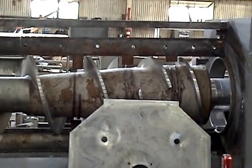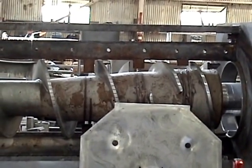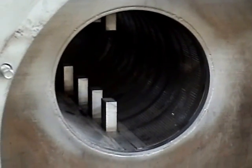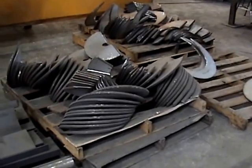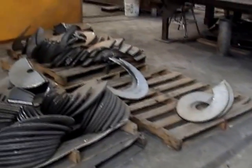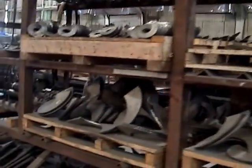The press we're running has five stages of compression. Here's an unusual view where you can see a press with four stages of compression, and the screen — a wedge wire screen with those slots, about fifteen thousandths of an inch. So we're running one half of the screen in one size and the other side in the other size. I'm standing on the screw that goes in this particular press. These are flights used to make the screws — here's more flights. These are all stainless steel, and we have oodles of flights.